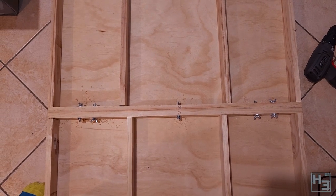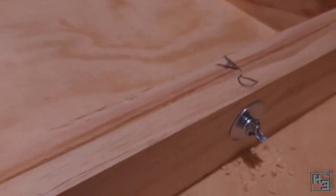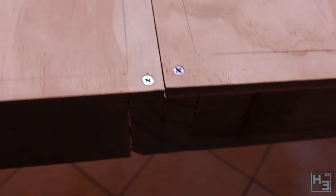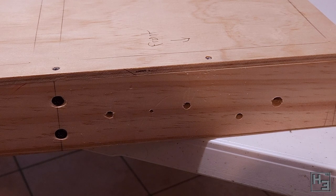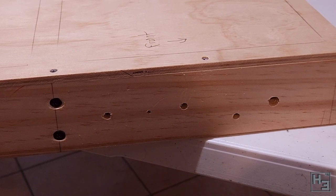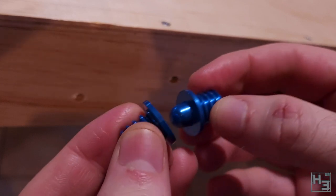There were five nuts to go with the six bolts for whatever reason, so I figured I might as well use up all of Dee's nuts. The boards went together well enough and they even stayed together when I picked the whole thing up and put it on the table. The gap seems to be a bit smaller now that everything's bolted together, and I guess that makes sense. Here we can see the array of holes I've drilled: the biggest one is for the end plates, there are two 6mm holes for the connecting bolts, there's a third one to act as a pilot hole so I could make an opening to pass wires through later on — I figure that's kind of future proofing. The small one is the pilot hole for the alignment dowels.